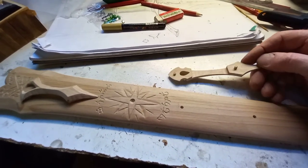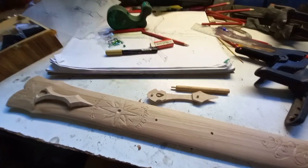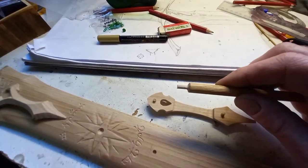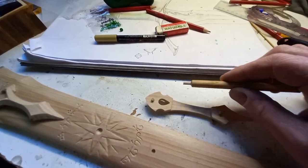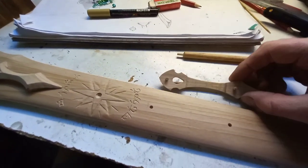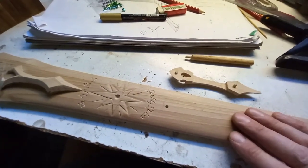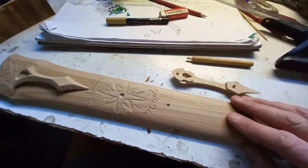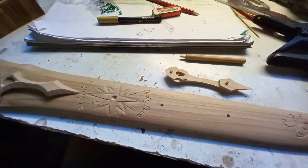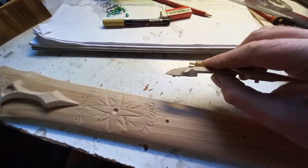I've just used dowel basically. This is what I wanted to show you — that's the dowel I've made. It's basically 10 millimeter red oak dowel which I've turned down to 4 millimeters on the lathe. I'm using that dowel to mark the holes for drilling in the scabbard. When I made this scabbard, knowing I was going to carve and drill it, I made it fairly meaty — normally I try to make scabbards fairly thin, but I've left this wider and thicker than I normally do, just to give me room to play with for the wood carvings. You can see the dowel only sticks in about an eighth of an inch, something like that.